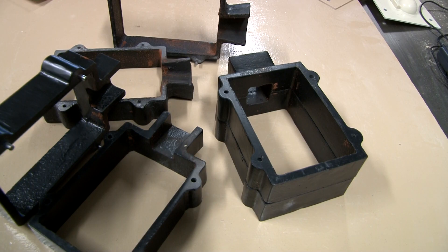Here's the two-part iron casting flask I used. They have pins in them and they work fine if you use them as intended for one item, but for match plates not so well — I had to cut the holes bigger to add slop because the pins aren't in the exact same places from flask to flask; there's no quality control. They range between 20 and 30 dollars on Amazon, and sometimes when you pull them apart the aluminum sprue at the top gets stuck — just take a screwdriver and pop it out. They're okay especially for the price point.